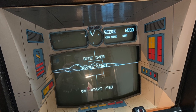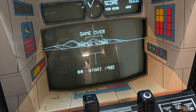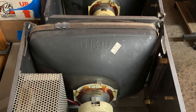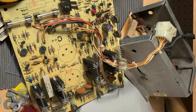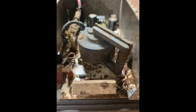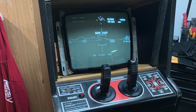What I did was hook up my monitor from the Asteroids Deluxe Cocktail, which is the same monitor, and behold it was indeed working. So I tried to rebuild the monitor that came with it — I actually already had another backup V2000 monitor as well. I recapped it, changed a bunch of resistors and transistors on the high voltage side and the diode — these little bottle cap transistors, which are pretty common to fail. And no matter what I did, this went on for about a month. I bought a very dirty high voltage side off eBay, couldn't get it to work. I got it partial working, half working, smelling, and I just broke down and bought a G05 from another collector.